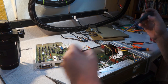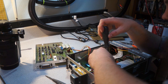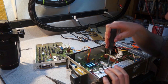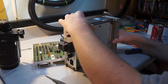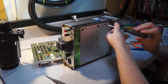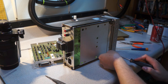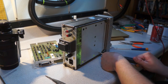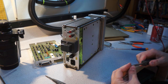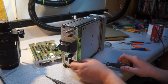There's one screw that goes in from the other side, for some reason I don't really understand. Oh, from the look of it, it's for grounding. So I think this screw is kind of the ground coupling, because this whole PCB is gold-plated from the look of it, and this one screw has a gold kind of rim around it. So these, I would guess, are just for supporting this panel. Or actually, I think I've got this backwards. This actually holds up the middle of the board, because otherwise the board is only supported around the edges, and it definitely wobbles a little bit. Anyways.